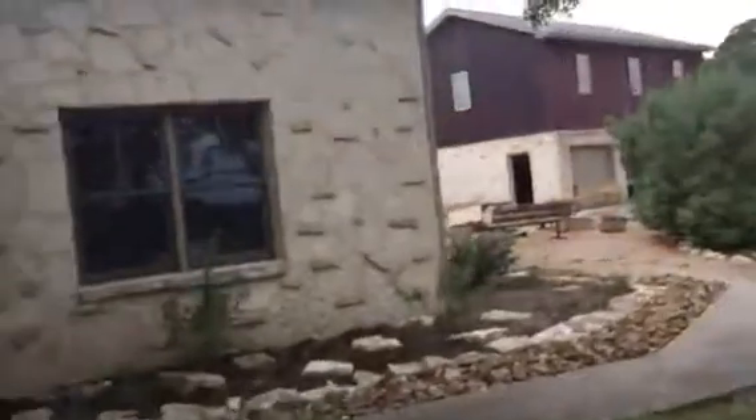This area here would be done in Hardie as well — tongue and groove porch ceiling is gorgeous, so we'll leave that alone. Everything underneath and around would be painted, and the exterior exposure would have Hardie plank on it. On the front there's some minor rot on the fascia, and this corner here is going to need rot repair. There's an area of rot right here that we'd cut out, replace with equal-thickness sheathing, then continue with the board and batten system.